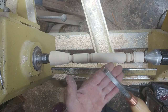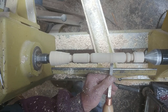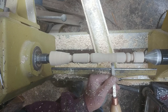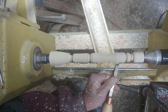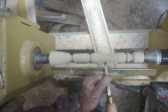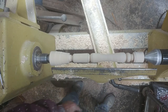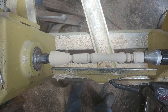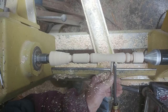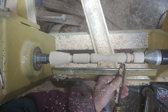One tool you can use is the carbide tip — you start right here in the middle and just go back and forth, carving out a handle. Another tool I can use is the roughing gouge — I can tuck down into that valley. One thing about that is it really makes a good clean cut down in there, even though it's a roughing gouge.